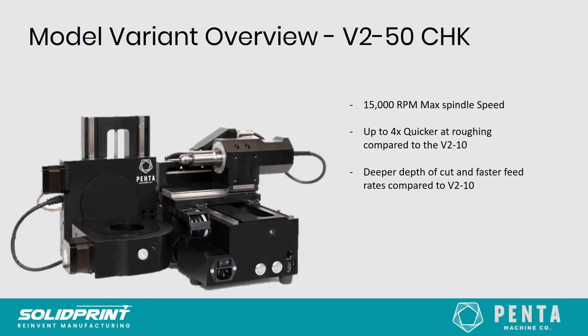You might not be able to tell the difference, but we've actually just changed over to the CHK. The CHK has the exact same feature set, machining wise, as the CHB. However, it does have some slight differences in that it can go up to a 6mm shank. Normally you wouldn't be using such large tools. However, that does give you the flexibility of using, for instance, a thread mill. Thread mills often only come with a 6mm shank. So if you were to use those specialty tools, it gives you a little bit more wiggle room in terms of what tools you can load into the machine with that larger shank diameter available to you. And then you can also clamp down on the tool slightly harder. So if you are machining very, very hard materials, that can be of use.